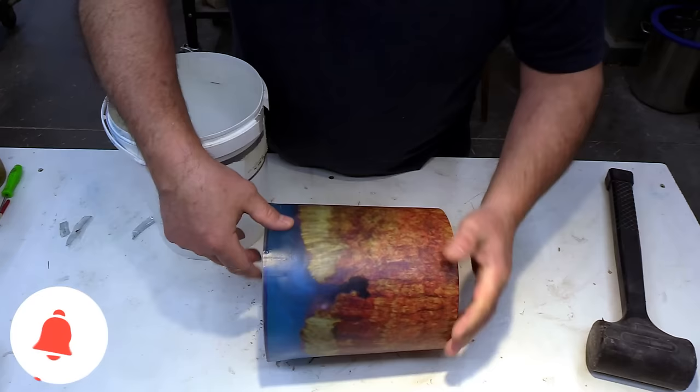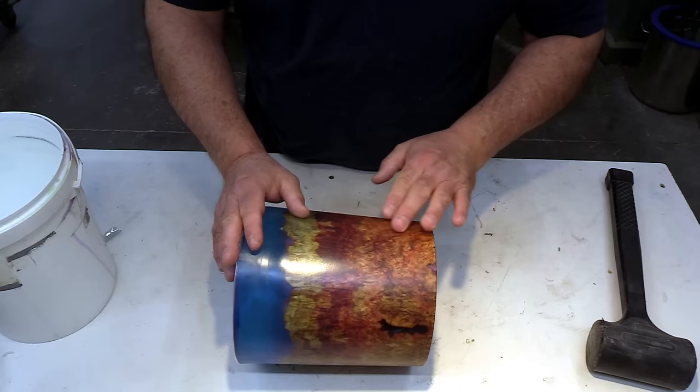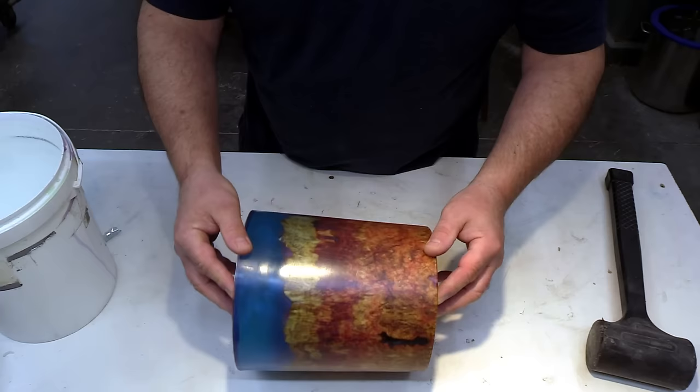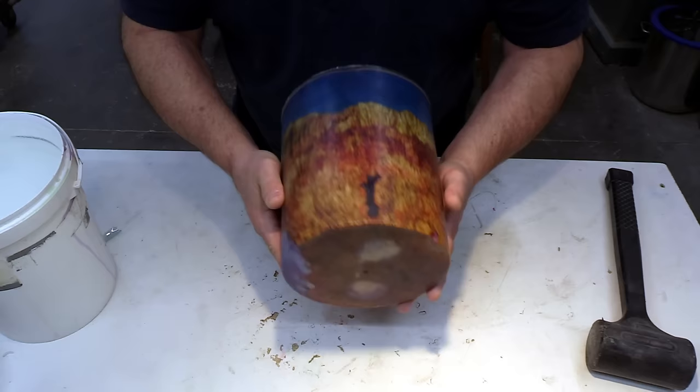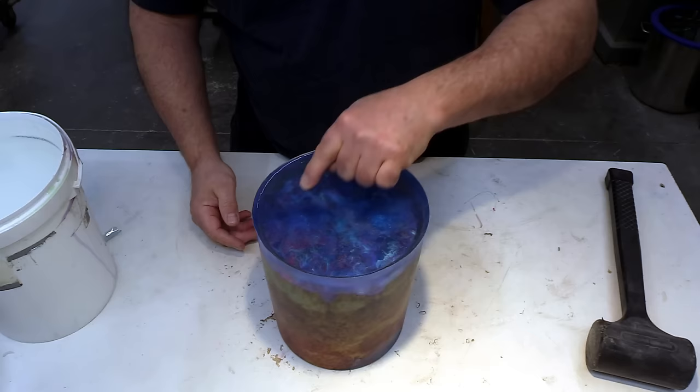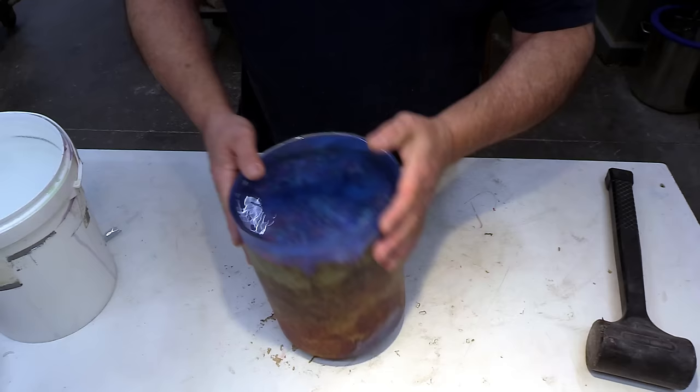The only issue that I've got with this piece is it's kind of an odd size, I find, for a lamp. I always think of a lamp as being maybe a wide base and then thinner and then maybe a little wider at the top. And we can certainly maybe do something like that here. But good solid casting, no thermal cracking. Didn't expect there would be anyway. Cool. First thing that I'm going to do though is I'm going to stick a glue block on the very top of this, because I don't want the live center going in and damaging what's going to be our ocean. And I'll drill a small hole here so that we can get that center.